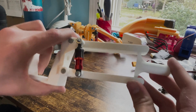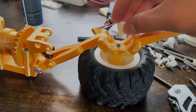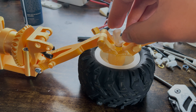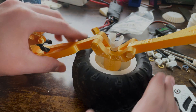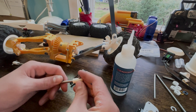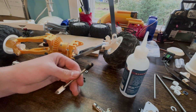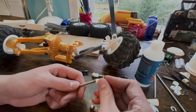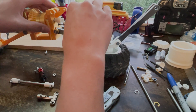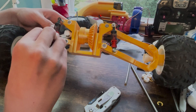Going back to the rear now, I CA glued the universal cups onto the wheel axle. To do that, I had to slightly disassemble the rear suspension. This was easy due to the pushpins and 3D printed C-clips, which hold most everything in this project together. Using some of those little pieces of steel rod that I cut up in the beginning of this video, I'm now going to make the axles by gluing these little adapter things to the end of them. I began to reassemble the rear suspension again, but this time with the axles in place, hoping that they would fit alright.